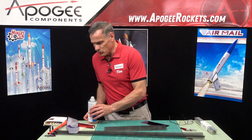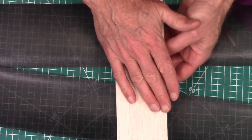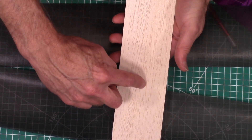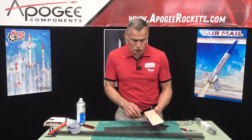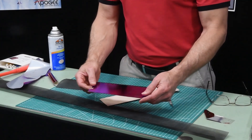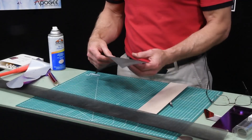The problem with balsa wood is that it's bumpy. We're going to sand it smooth to try to eliminate some of those ridges because the wood grain has hard and soft wood mixed together — the dark part is a little harder than the lighter color. That's going to show on your final piece and we don't want that. We want it nice and smooth so that it's a lot more reflective. You'll see the grain if it's there, so we want to try to fill it. First we're going to sand it, and then second we're going to put on a coating.